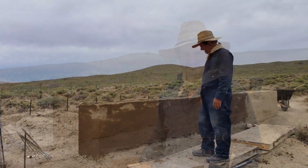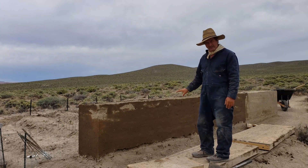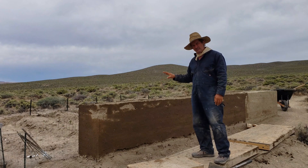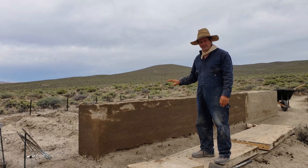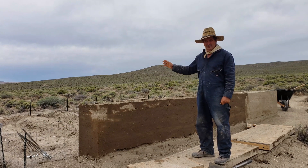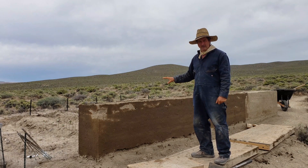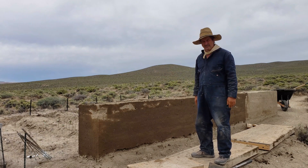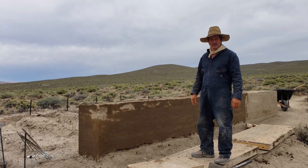In any case, I think I'm done with this experiment. If you have a very specific project, maybe rammed earth is the thing to do, but you're far better off spending an extra $120 on cement and $50 on rebar and just doing it with stabilized rammed earth, having a product at the end that's going to last for generations.